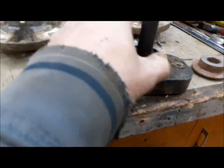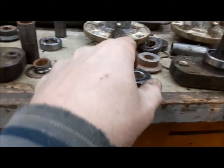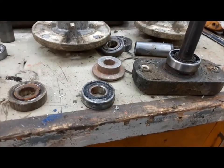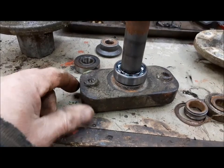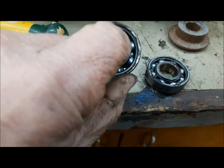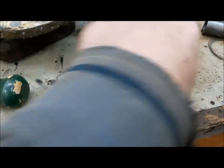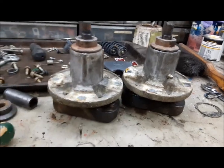This bearing doesn't want to come off, but it's nice and smooth, so we're good to go. I'm going through the rest of the bearings and picking the ones I think are the best — I've got to find three more. We're going to leave the seal on one side to keep stuff out, and remove the seal on the side that faces the grease. That way we'll be able to grease these spindles, which is part of the reason they fail. Now both have a lower bearing installed, so we can go ahead and install them in our housings, then put the top bearing in. Here are two bearings for the upper — they run nice and smooth. I've pulled the inner seals out of them. We'll put them on and then go over to the press and push the retainers back on. Here are our two finished spindles — I pressed them together, pumped them full of grease, and they're nice and free and run smoothly.